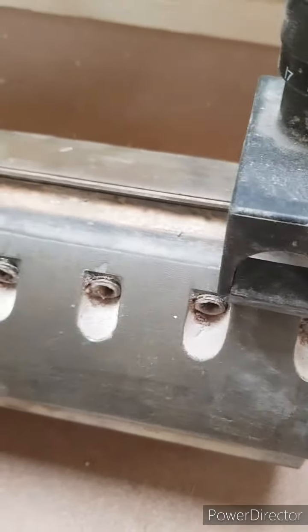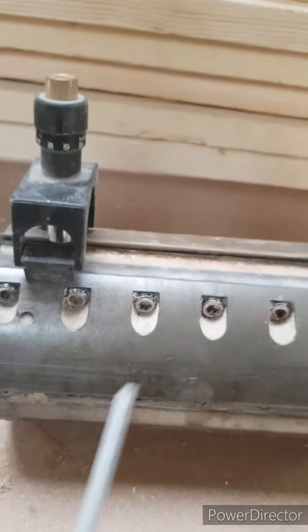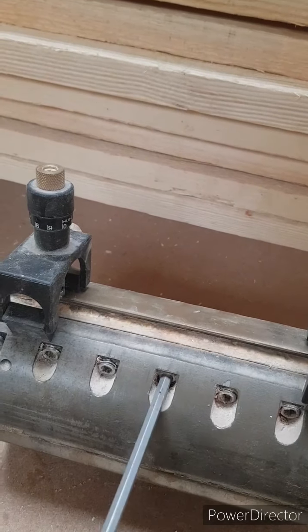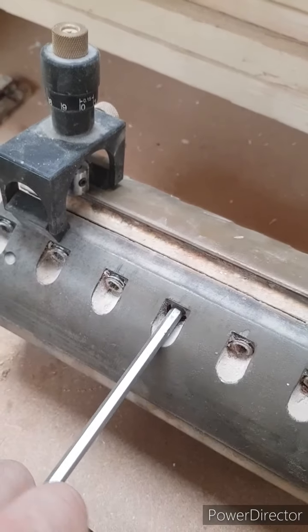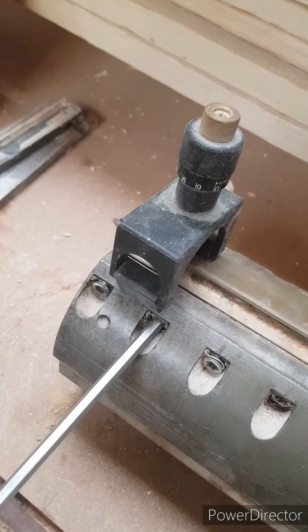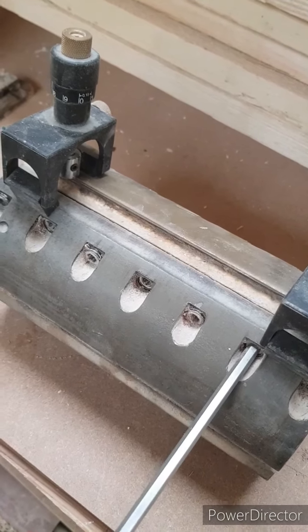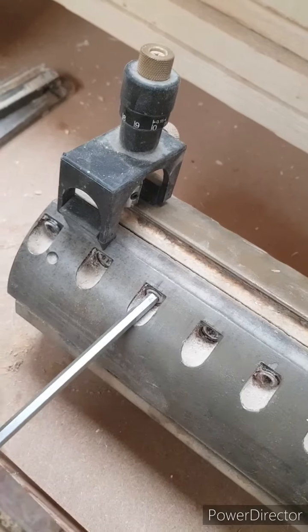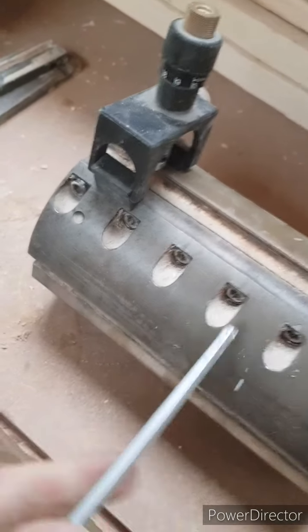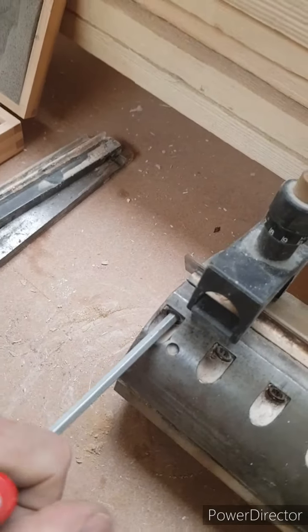So once you've got your blade where you want it to be, look, always start with the middle. Gives even pressure across both. Give it a little bit of a tweak, then go to one close, a little bit of a tweak, opposite end, bit of a tweak, and then you can just tighten them up. Make sure they're nice and tight, because you don't want one of these buggers coming out at you. I've had it, and it makes you go a little bit pale, especially when the bugger sticks in breeze block wall at the other end of the workshop.